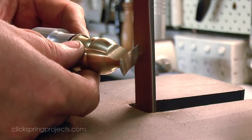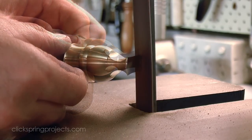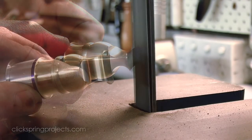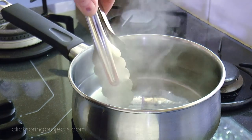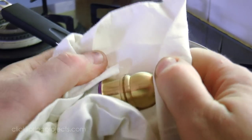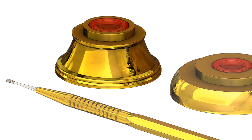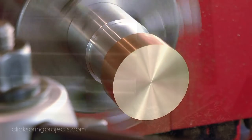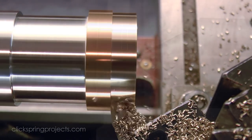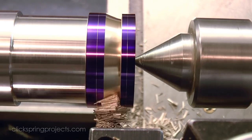Now the situation is somewhat improved by applying a good quality oil directly from a bottle nozzle, but it's still very difficult to avoid applying an excessive amount of oil. Too much oil in a clock oil sink, for example, simply leads to it all trickling away, drawing all of the oil away from the bearing surface. And again, it ends up migrating somewhere it shouldn't be and eventually causing a problem. So the best solution by far is to make sure that the correct amount and type of oil goes exactly where it needs to be. And to do that properly, you need a precision oiler.